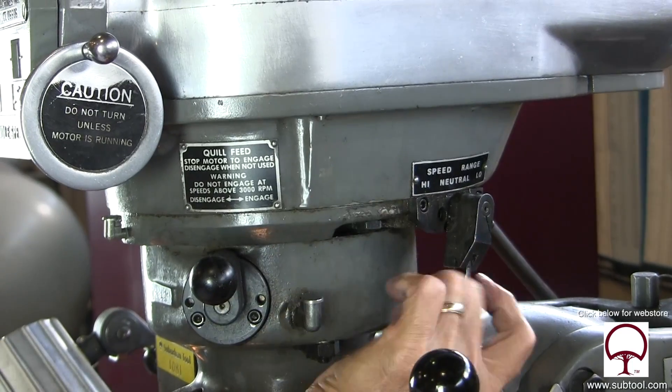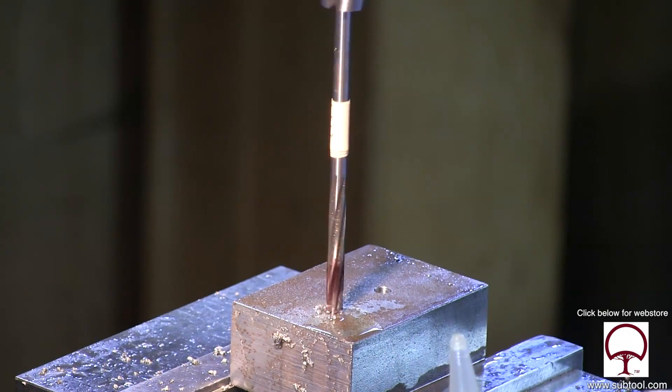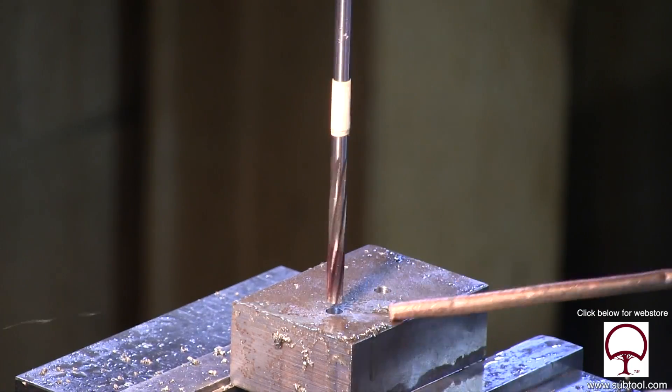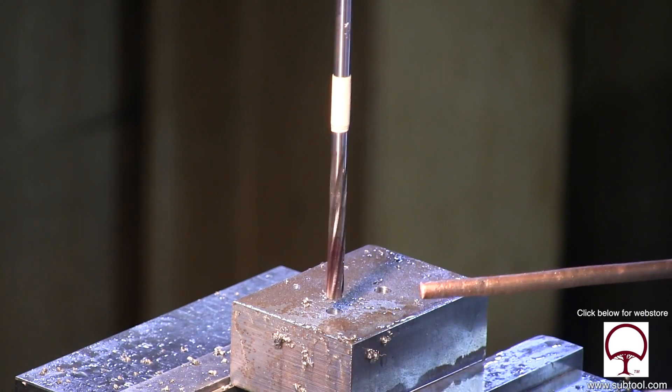Here we're going through and we're changing our speed from high gear to low gear, slowed it down quite a little bit. But if you look at the top of the picture, you can see the real diameter. The flutes kind of give you a false reading as to the speed. I like to blow the chips out of there — I think you get a better hole when you're reaming.